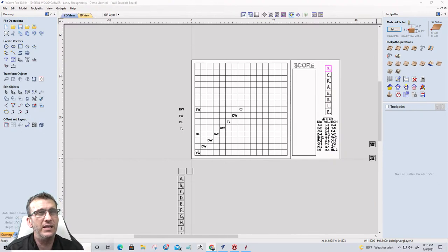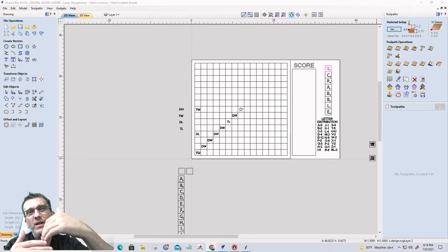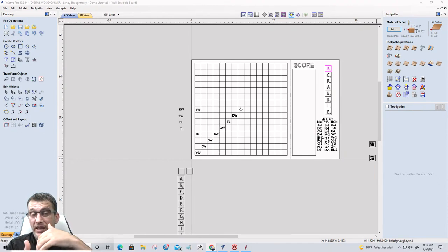I haven't seen many tool marks inside V-cut letters unless you're chattering, which means your bit can't remove the material fast enough and can't keep up with the feed rate. Your feed rate's too fast and the bit's not spinning fast enough to remove that material, then it's chattering and creating tool marks inside that cut. That would be the only time I see that, or a dull bit that's tearing through the material, again causing a little chatter, and not shearing through it.